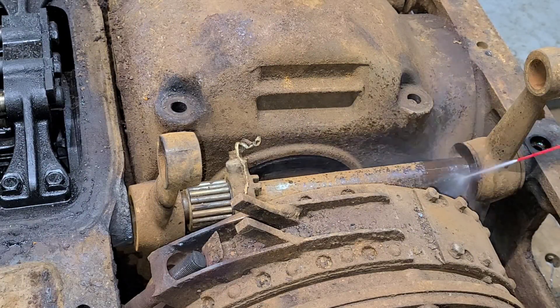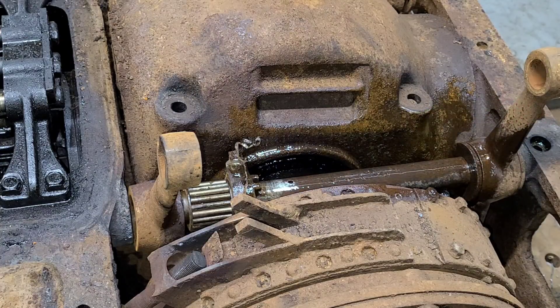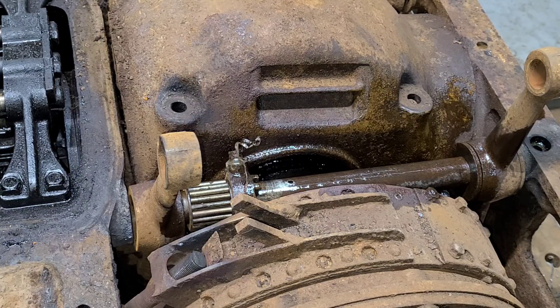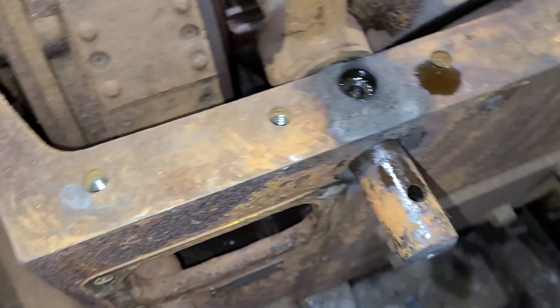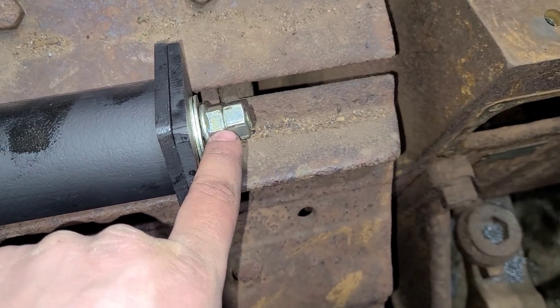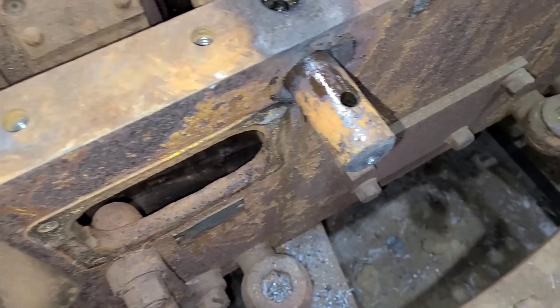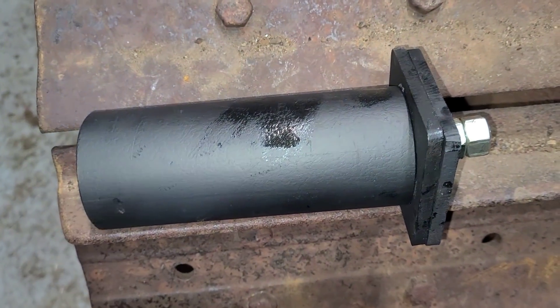Shoot a little brake clean in there just to get that dust off — I need that rust dust from the emery cloth gone. We'll let that evaporate, put some 30-weight on it, and hopefully pull the rest of the shaft out. Just to show you the progress we're making — the shaft is out, and that's what we started with. We're making quite a bit of progress. The reason I have the other one off is I figured for how easy the shaft's moving, I'm just going to switch to this 6-inch pipe. I know some of you are going to ask why not just start with that one. The reason is this threaded rod isn't terribly strong, so to give it the best chances I figured a shorter piece would hold up better just to get everything moving, and then we can always switch these pipes out. So we'll get this 6-inch one on here and we'll keep pulling.